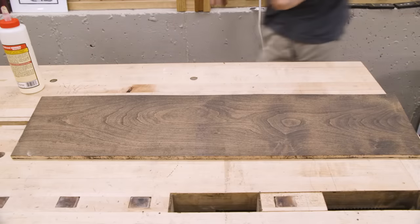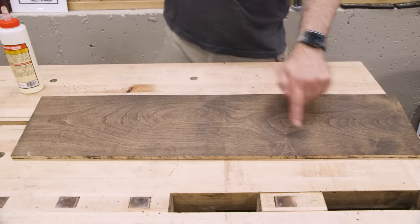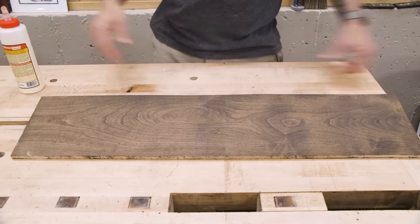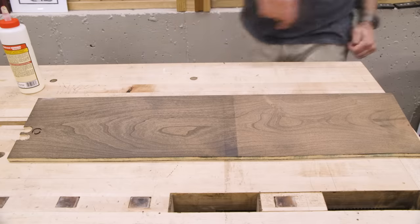If you're wondering whether the addition of that water-based finish actually makes a difference — well, I can assure you it does. We ran a lot of side-by-side tests and every single time, the solution with the finish added produces slightly better results. Not dramatic, but enough to say it's worth adding. In this example, we have an alder board with my new formula on the left and glue size on the right. You can see a lot more blotch around those little knot areas. Here's the other side of the board with the solutions reversed — as you can see, the new formula dramatically tones down the blotching around the knots. I'm not claiming this is a miracle solution, just that in my testing it is the most consistent and seems to work best in the most different situations.